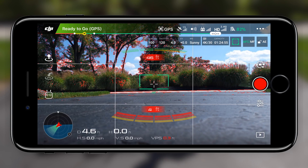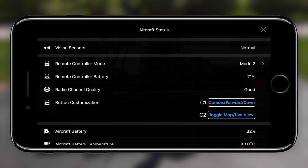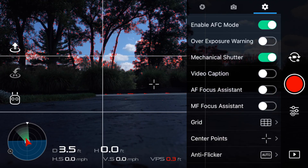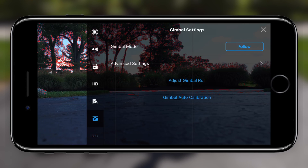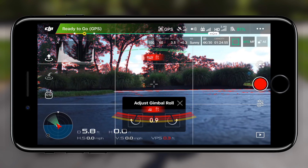Now it is time to do a check on all of the drone's systems. Click in the top left corner and scroll down to be sure that all systems are normal and you have no errors to deal with. Once all systems are good to go, it's time to set up the camera. I usually double check my resolution, white balance, and other settings before messing with my aperture and shutter speed. Typically you'll have to reset those when you're up in the air anyway, but it's good to set a basis. If you notice that your shot is tilted, you'll want to correct this by adjusting the gimbal roll — this may need to be adjusted depending on what subject you're looking at, but it's good to do a slight correction right at the beginning.